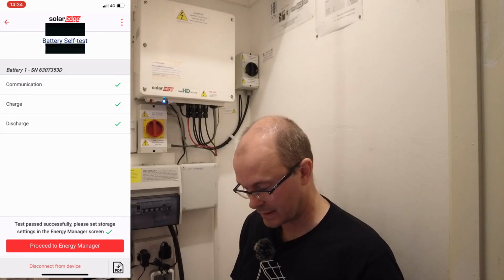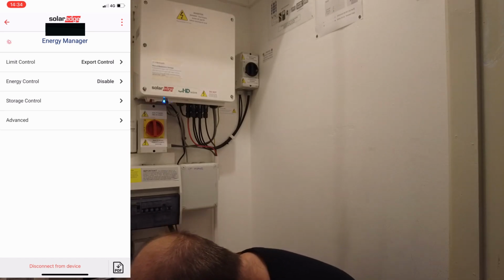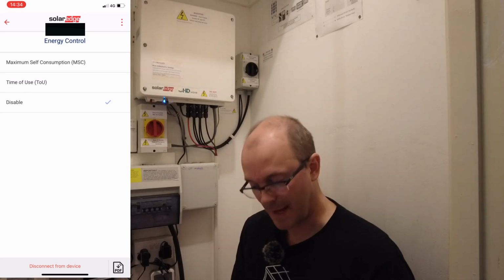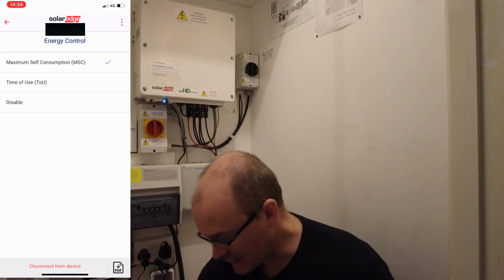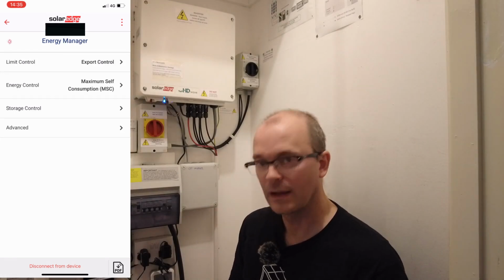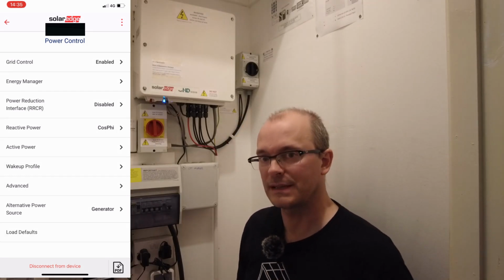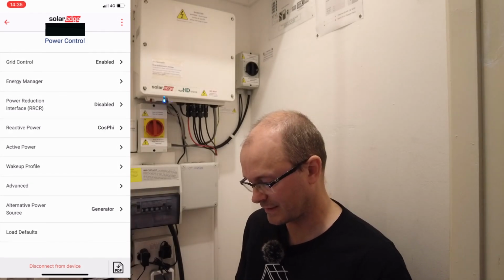So now we proceed to Energy Manager. So we have got energy control. And we want to maximize self-consumption. So that is now set. So the most important thing now is to disconnect from the device. Until you've disconnected from the device, it will not update the monitoring platform. So we select disconnect from device and we're disconnected.